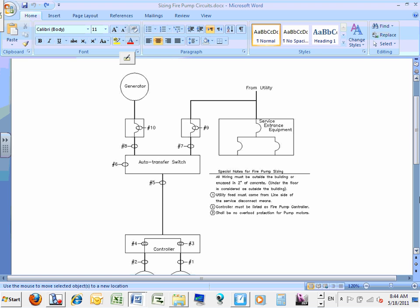So there's a fire at Dunwoody. We have a fire pump, and we have a generator. The firefighters walk in, shut down the power so they can fight the fire completely, and they leave this fire pump energized, and we're running on utility to fight the fire. The sprinkler system is on. Now, if the power globally goes down, then that big generator will handle it. And by the way, that generator is your emergency generator, could be feeding other things too.